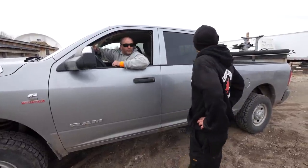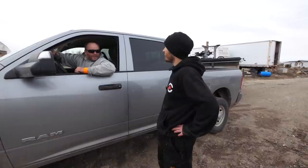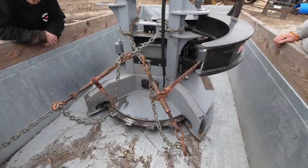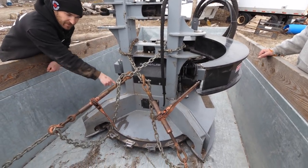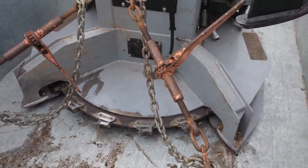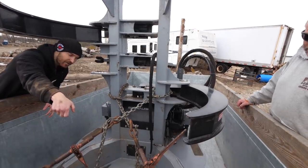He's doing some running around, picking up some lumber, and gets to drive the boss's new truck. We've got a feller buncher — it goes on the skid steer, and the grapple's in there too. So this entire thing mounts onto a skid steer. It's a big circular saw blade with some gnarly teeth spinning the entire time. They drive up to the tree, the arms come around and grab the tree, cut off the bottom, and they're able to place the tree down on the ground.